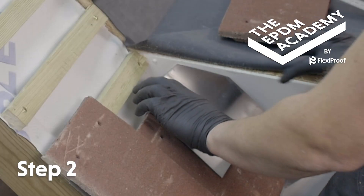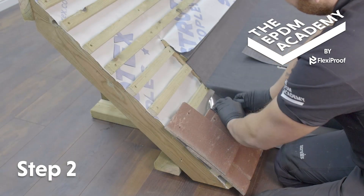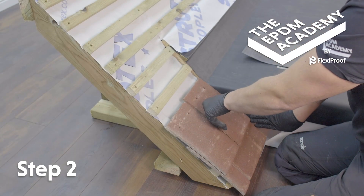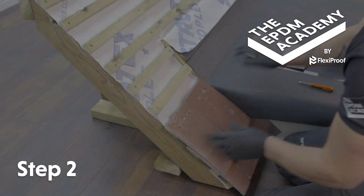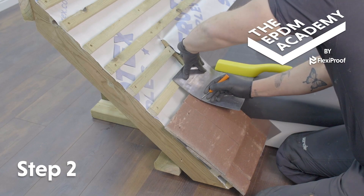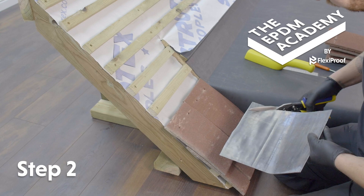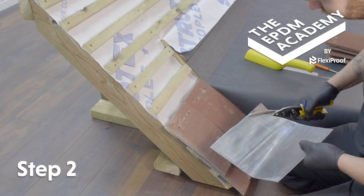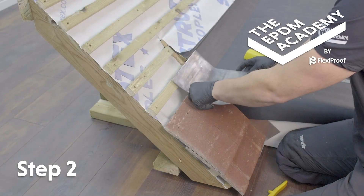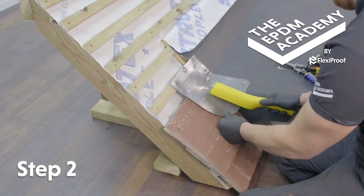Fold down the opposite corner of the zinc soaker and use it to hook onto the corresponding tile. Fold the membrane down over the fascia and zinc soaker. Place the tiles onto the zinc soaker, then position a piece of lead flashing and use a scribe to mark a curved corner. Use metal shears to cut a curved corner on the lead flashing and create a lead saddle. Position the lead saddle, use a hammer to nail it into place, and a lead beater to shape it into the angle changes.